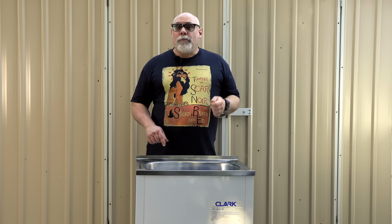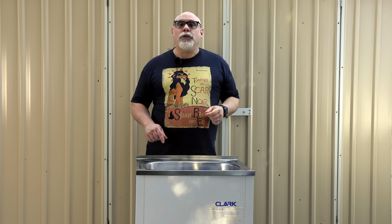I bought these ultrasonic cleaner parts from AliExpress, and you'll find links in the description. Just keep in mind that I purchased drivers that are powered by 220 volt AC mains. Make sure that when you buy your drivers that you buy one suited to the mains power voltage in your neck of the woods.